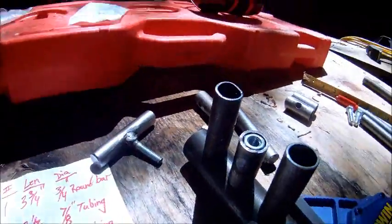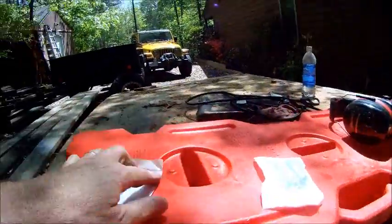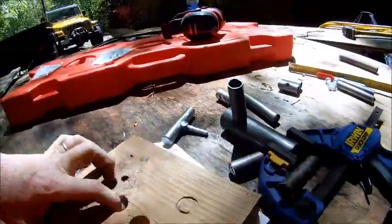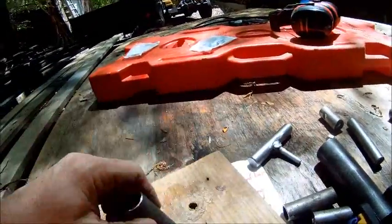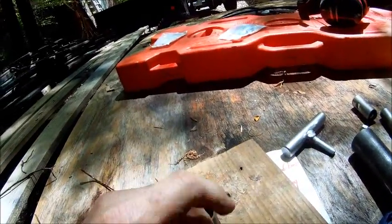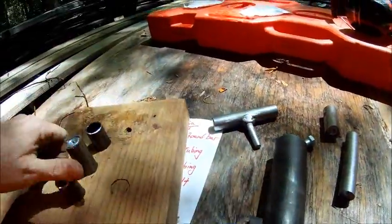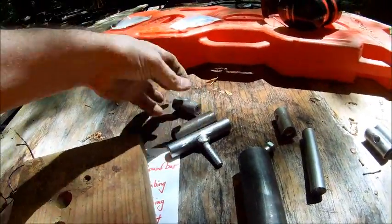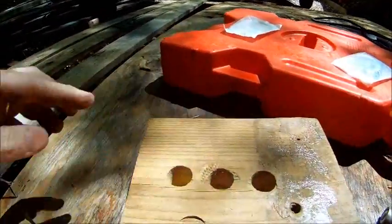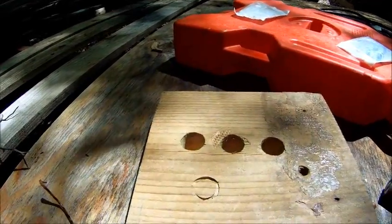When you're all done, this is what you're going to end up with — a short center piece and two outer pieces. These two outer pieces are going to fit right inside that opening. You may want to build a jig like this to put your pieces in to hold them vertical while you weld them to your center tubing. In my case, I'm going to mount it to a piece of inch and a half tubing. You may want to just weld it to a flat piece of steel, but having a jig like this where you can put all three in there and hold them vertical and evenly spaced while you weld it will probably help.